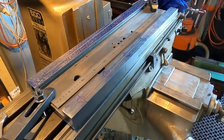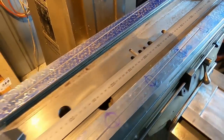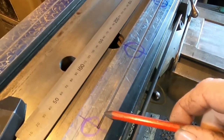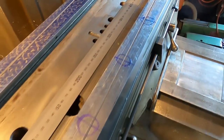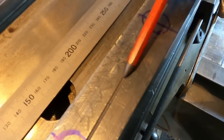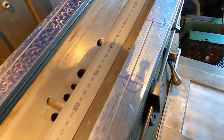So we have our cross slide off the lathe set up in the Bridgeport. So we're going to give some of these oil grooves a bit of attention. So the existing groove that's in there, it's a bit of a dismal affair. It's a very shallow groove running at a very shallow angle, probably 3/4 of the length down, which is, the length is all right. But what we want to do is go in with a 6mm ball nose end mill and just widen that groove out just a touch to make it easier to round off the corners.